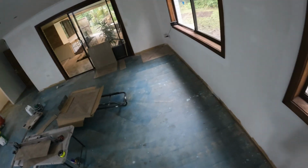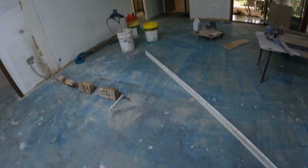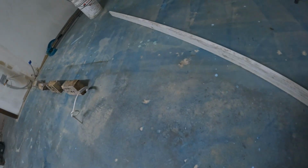So with this floor, everyone, it's going to look like a parquetry look-alike. So I'll mix up some glue. This time I will be back buttering my tile because it's a 750 by 750 tile, so it's pretty big. The concrete, this slab was done 70 years ago. It's a 70-year-old house.